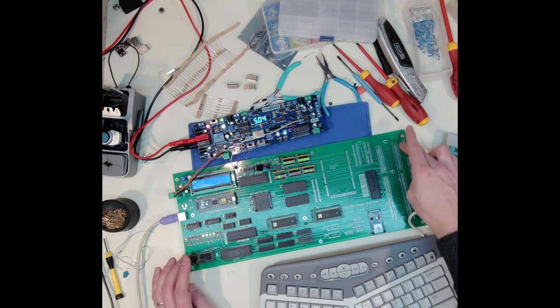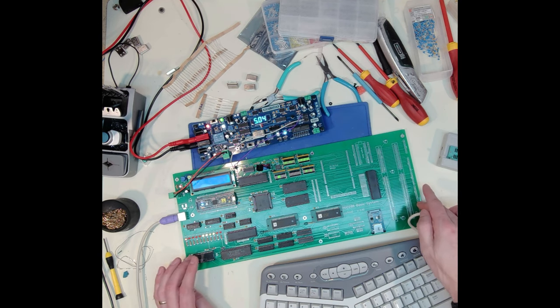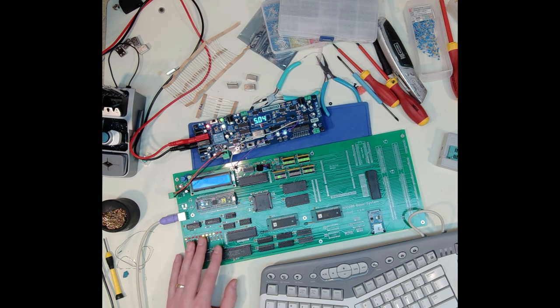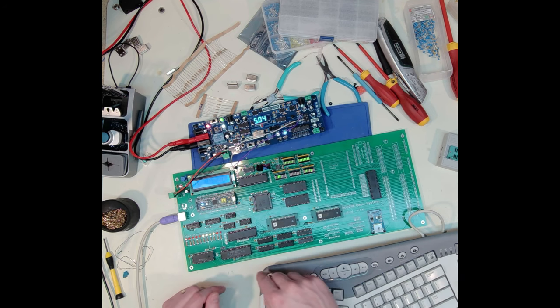I still don't have any of my resistors on the bus, the external bus. I'm really not using a whole lot on the external bus yet. I don't have any internal bus resistors. That was a design change I had made after I had ordered this board. So if I decide I want to put those in, I'll have to do that later. But at this point, it seems that with this 8 megahertz at the processor clock, things are working fine.